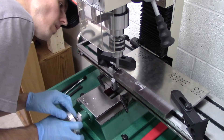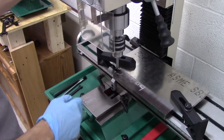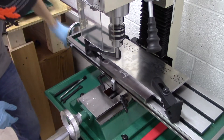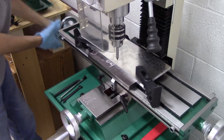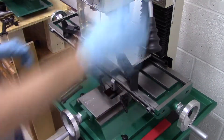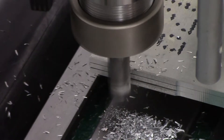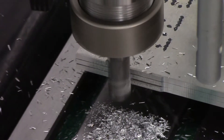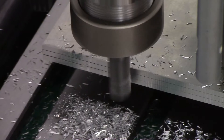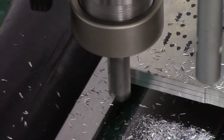Something else we learned was that our method of centering the work doesn't work all that well, and during final production we're going to have to figure out another way to do it. The way you see us doing it here was not only most likely incorrect, it also took a while. When you need to put out a lot of pieces in a given time frame, you need to make smart use of that time. More than likely we'll be using a vice next time. The vice we purchased is really cool because it allows us to take off the jaws and reposition them to accommodate larger pieces of work, which will allow us to make much more precise measurements while keeping the work firmly on the table.